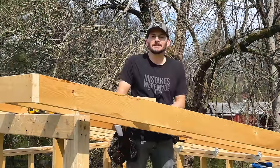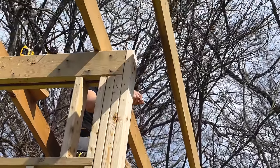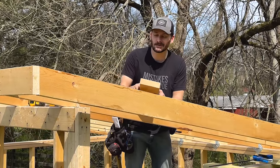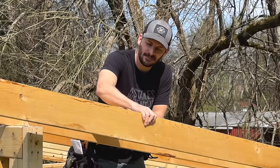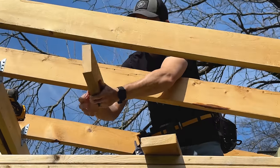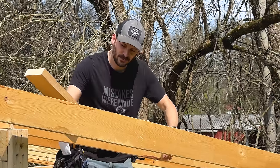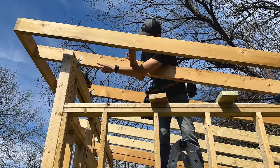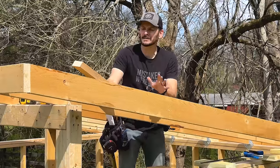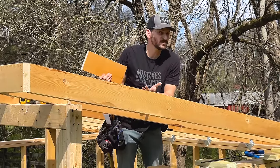The way I assembled this, I don't have rafters on the outside of the building — I did that to save material. Doing it this way saves you either one or two 2x6s and saves money. Since we don't have support there, I'm going to put in some blocking in between the supported rafter and the outside board. After that I'll build in another piece of support underneath and put some little cripple studs underneath, which will transfer the load so everything will be nicely supported.